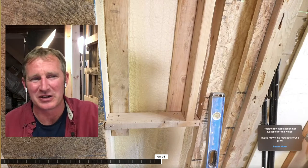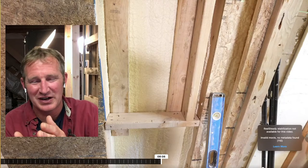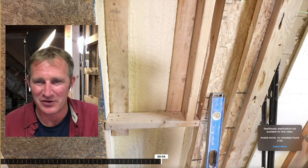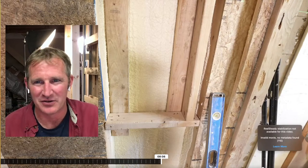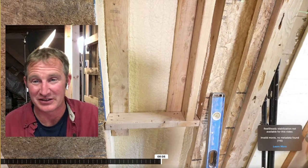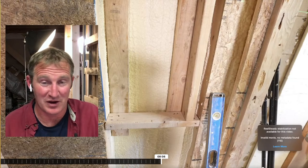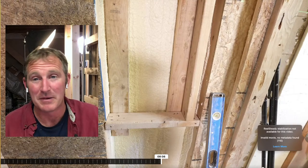And it is somewhat a little bit more critical on these smaller tiles. These 3x12 tiles, you don't really have a lot of flexibility, especially if you're going to try to miter them around the top, like trying to cut a tile straight down the middle and then do a miter. You're going to end up having chips on that tile. So I always like to try to have my factory edges and just miter the back of it, so you're not cutting the 45 on the face of the tile, especially some of these ceramics. They can be very, very delicate. So you have to give yourself even a little bit more room with that.